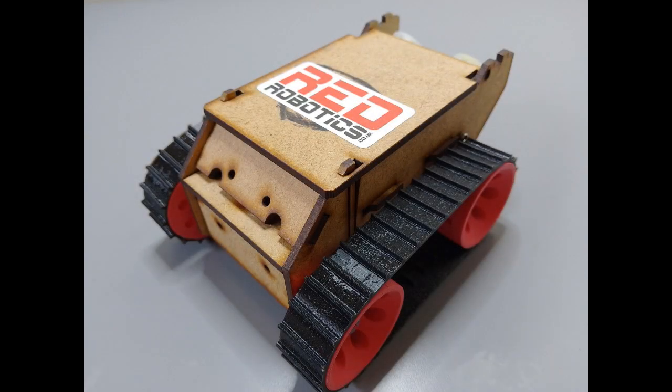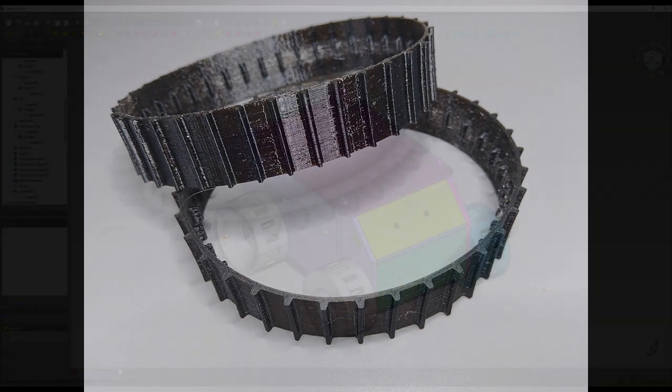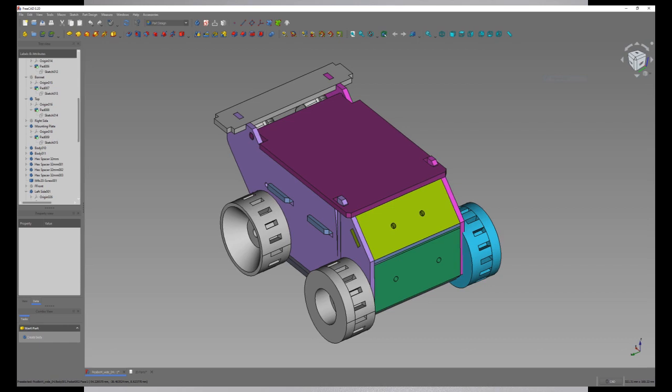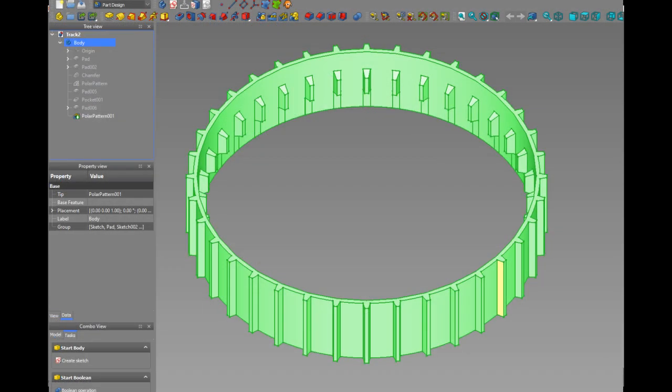As for the chassis, I wanted to keep it as small as possible to keep costs down, but still able to fit a Pi 3A+ sized board and a 6×AA battery pack. I wanted the robot to be tracked, and I found some cheap Lego-compatible tracks on AliExpress — those factors determined the overall size of the chassis. I wanted the chassis to mainly be laser-cut, as it's quick and cheap, but there's no reason the parts can't all be 3D printed. The wheels are 3D printed, and in the end I printed the tank tracks in flexible TPU filament to keep the overall cost down.